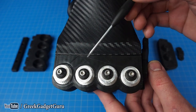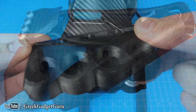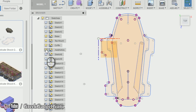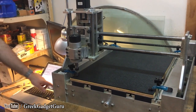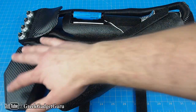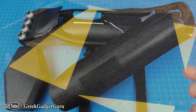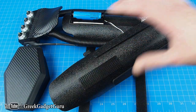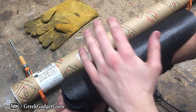It will arc across all four — it just has a tendency because these are a little bit close. Then this would go over top of it. The majority of this build is made out of ABS plastic. I designed all these pieces in Fusion 360, then converted it to a DXF, sent it to a program called Easel, then exported the g-code to an SD card, uploaded it to the computer at Hack Pittsburgh, and then cut all these pieces out.